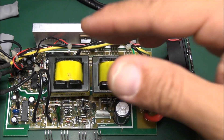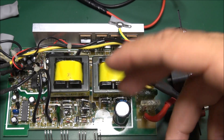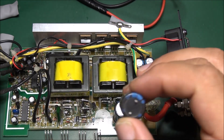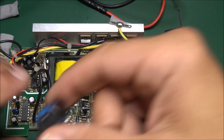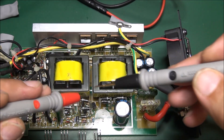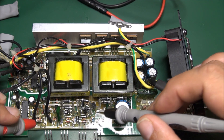After the coil, you work with a square wave — the same square wave as the input but at high voltage. This high-voltage frequency is rectified by these high-speed diodes, and this voltage is filtered by this capacitor. You can see a missing capacitor here because I dismantled one to see if it showed any sign of damage. To begin my investigation I measured the impedance to find out whether there is a short between the leads of this capacitor.